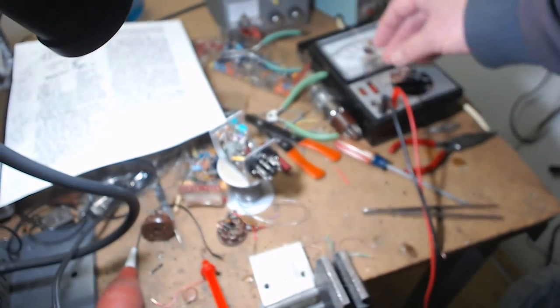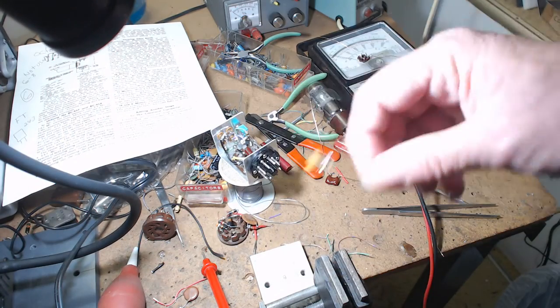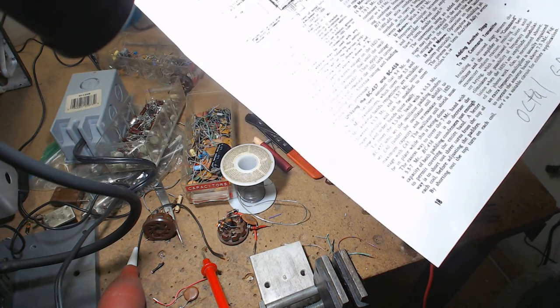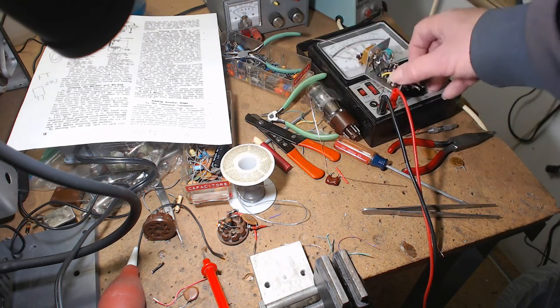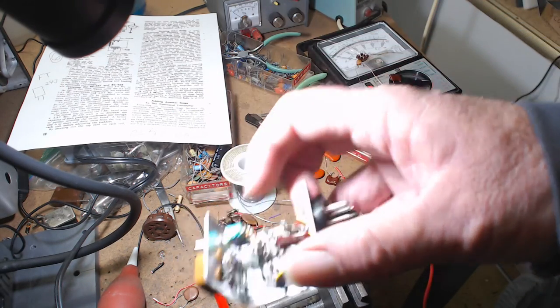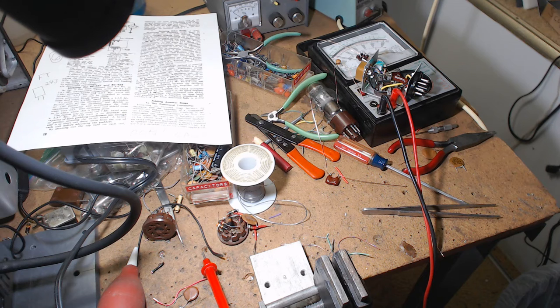This also goes in the grid circuit — two 10s in parallel to give me 20 picofarads. You can see two resistors here in series with some really weird values: 72k and 27k — not very common resistors. Two quarter-watt resistors in series still add up to a half watt. This one across the crystal doesn't need a full half watt. I'll also do two resistors in series for the one that sits in the screen circuit, and the plate gets direct voltage.